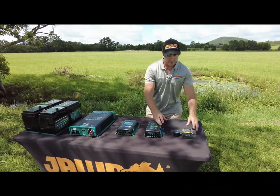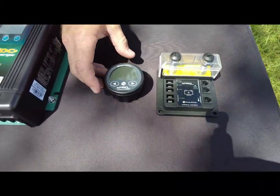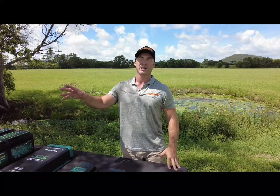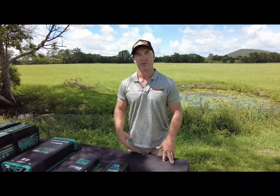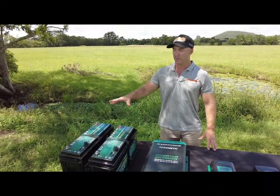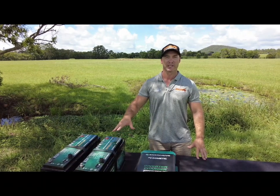All this is then monitored by your Enerdrive E-Pro Plus, with a shunt where all your electrics run through. The E-Pro Plus gives you a readout of your state of charge — where you're sitting percentage-wise. It'll show you how much you're pulling in or putting out, add everything up, what's coming in and what's going out, and tell you how many hours you've got left if you are using something with high power draw. You can also use the Bluetooth monitoring app to keep an eye on the batteries individually. Here's your 12 volt Enerdrive setup — we haven't tried to skimp and save a few dollars. We've made sure you have the best products in your van so you can be out on the road for a long time and have peace of mind while off-grid.